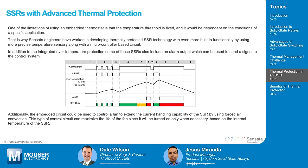You attach a fan to the SSR. The internal temperature measurement is used to monitor at which point you need to activate the fan, and that allows the SSR to manage a higher current while maintaining a certain size. This type of control circuit maximizes the life of the fan since it will only be turned on when necessary based on the internal temperature of the solid-state relay.